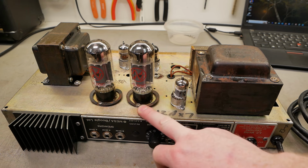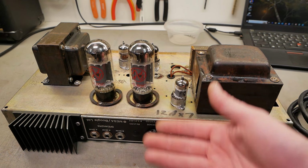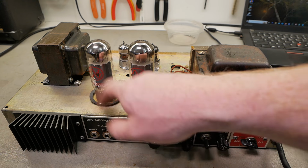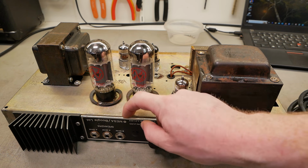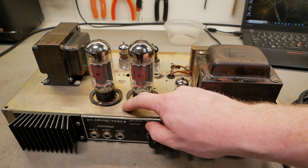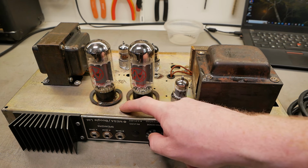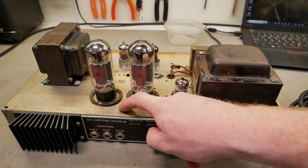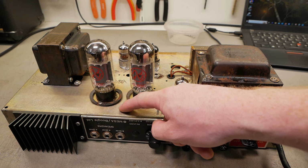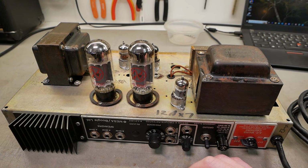I think they use zinc anneal or zinc alum or whatever it is, that sort of matte gray looking stuff you see on all the modern Marshalls, because it's a bit of a cheaper and less toxic process. I think from memory this is the stuff that the Erin Brockovich movie was all about. The hexavalent chromium was used in the plating process, so they've discontinued it now and used some other process. You can still get the yellow zinc chromate, but they use some other precursor. But as always, the old stuff tends to be the more durable. The most toxic stuff seems to be the best for the job.